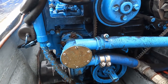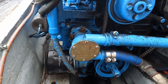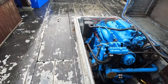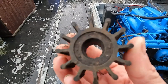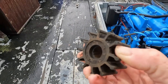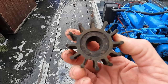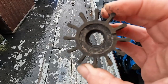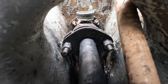As you can see there are six small stainless steel screws, and beyond that there's a paper gasket. You need a long-nose pair of pliers to take out the impeller. It's always advisable to have a couple of spares because over time they tend to crack, and if they get dry or you run the engine without water it can take off the blades, which affects the way water gets pulled into the engine. It's always nice to have a couple of these on board.